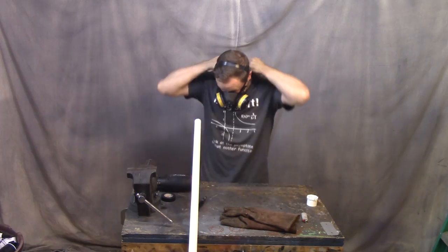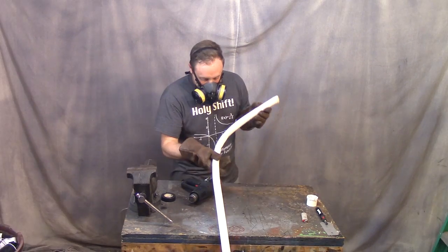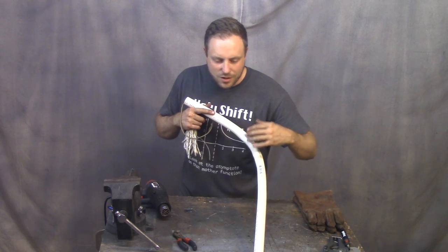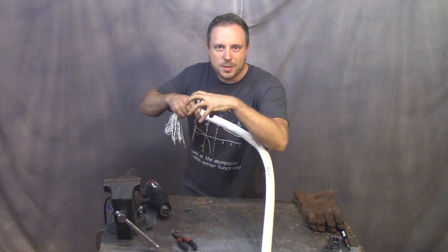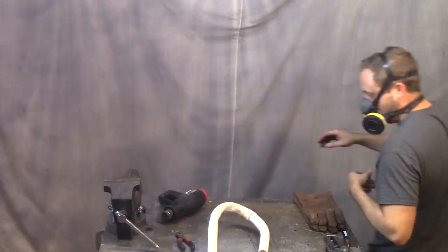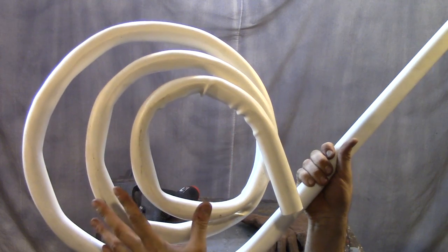Time to make this hot and try not to die. See that smoke? It'll kill ya — literally! This stuff is so thin, all it wants to do is kick. I thought the thin stuff would be easier to shape — totally wrong. Mandrel bending is when they make a bend in a pipe and the inside diameter stays consistent the whole way around the bend. Crush bending is when they squish it. The mandrel is the thing they pull through the middle of the pipe that stretches it back out to the same inside diameter. I rigged this up as a rope mandrel because I didn't have anything else to use — I'm going to pull 550 cord through and bend the crap out of this pipe. But my mandrel idea obviously doesn't work very well because this thing looks terrible. This is basically a proof of concept so it doesn't really matter.